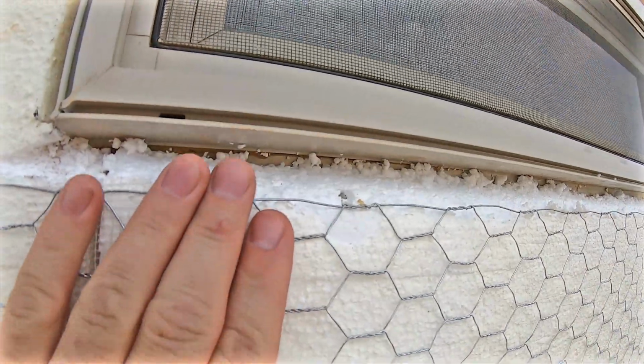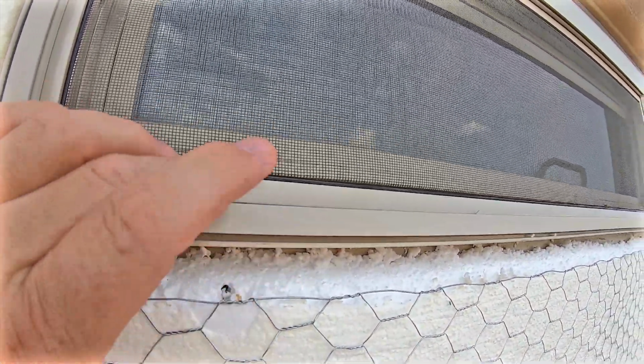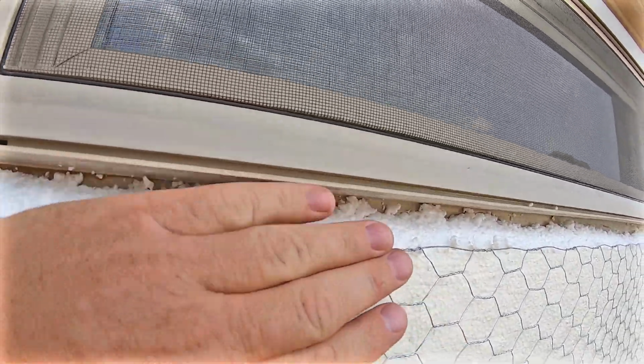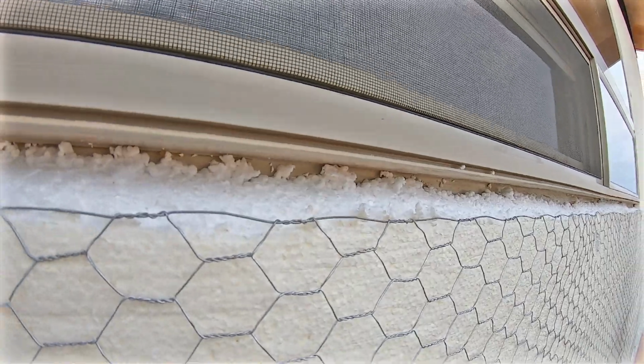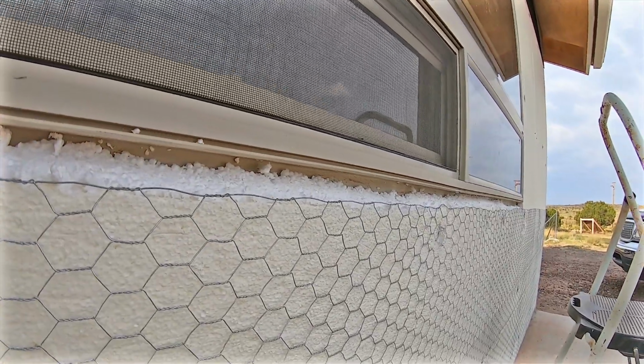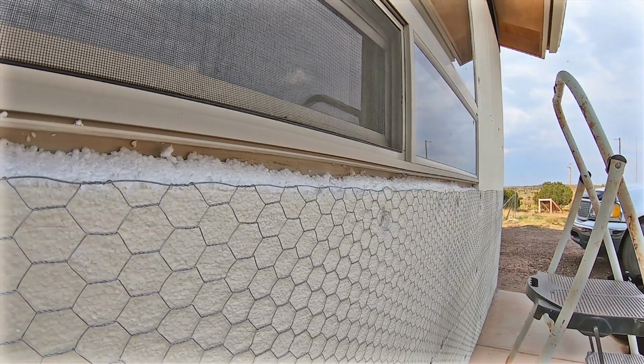We're basically going to take the stucco right up to the window. We're not going to do any outlays of the window. We're just going to go right up to the window. So we went ahead and cut a 45-degree angle at the bottom of our windows and sides to our windows and around our door jambs, so that we'll have a clean, flush stucco look.